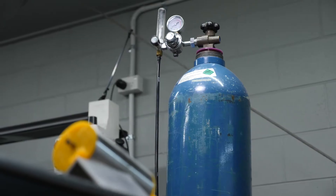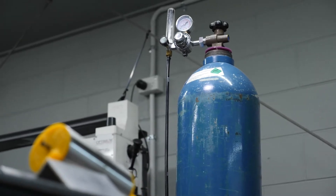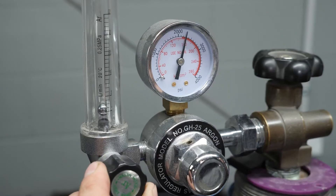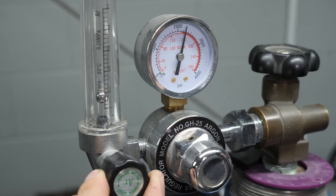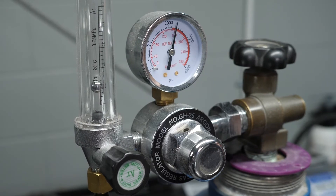For our demonstration, we're using a separate argon bottle dedicated to purging. However, you can also purchase a second regulator for your main bottle. The best option will depend on the amount of purging you're doing, but purging can use quite a large volume of argon and can therefore empty your main bottle quite quickly. As a guide, the gas flow for purging should be set approximately the same as the gas flow you're using for the torch, although if there are lots of potential areas for argon to leak out, you may need to raise the gas flow considerably higher.